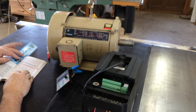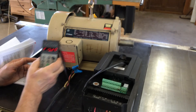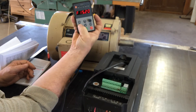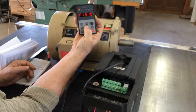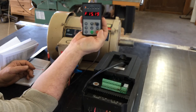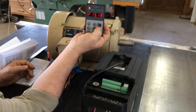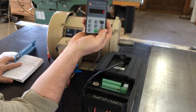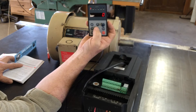Actually it's function 15.19 — we're at 20. To get into your digits, use the side arrow. We're going to 19, so you go down. Now we're at 15. Now that we're in our function, we want to enter data. The function right now is at one — factory is zero. You need to select it to one, and that's just by up and down arrows.